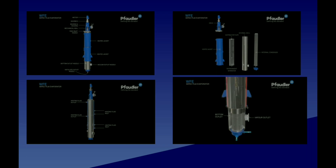This is called the distillation process. We are getting three outputs. At the bottom we have a separator where it separates the concentrated solution, distillate solution, and vacuum outlet. The vacuum outlet is used to suck out vapor present in the condenser. At the bottom outlet nozzle the concentrated solution exits, while the distillate solution is collected at the distillate outlet nozzle. The vacuum is used to suck out vapor present inside the internal condenser and internal shell.